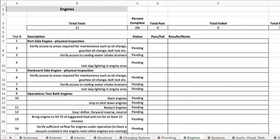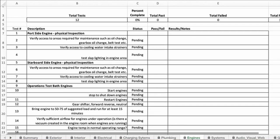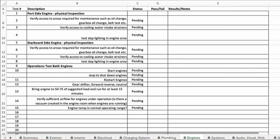For your engines, make sure you can easily access all the strainer baskets and get around the engine to do things like change the oil or switch over batteries if one goes dead. When you get out for a run, bring the engines up to temperature and run them for quite a while. Make sure they operate within normal temperatures and that you're getting plenty of air into the engine compartment — if you have to break a vacuum seal to open the engine compartment door, you're starving your engines of air.